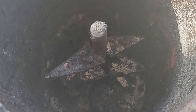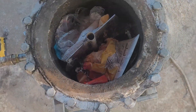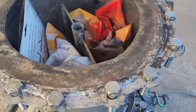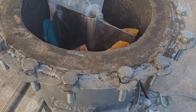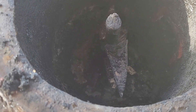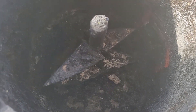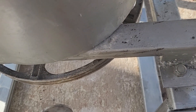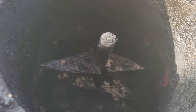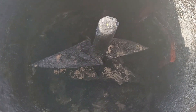Right now I'm showing you some of the changes. The first change: in my last video the blades of this agitator were more like a paddle, but that required a lot of torque. So I made this look more like a blender. I do have some issues with resistance — you can hear it, it's metal against metal — but this will have less resistance while still agitating the plastic mixture just as much.